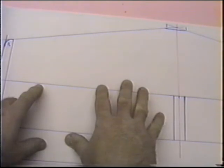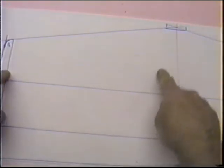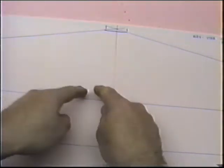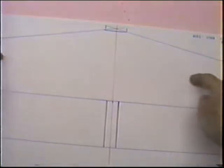We're going to go get the C-grain wood, 16th C-grain, and we're going to lay out the stab in one piece. Now, the way this type of a tail gains its strength is there's no joint. The grain needs to go parallel to the trailing edge, and you need to have one piece.